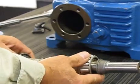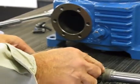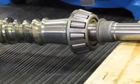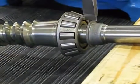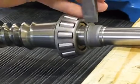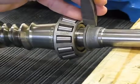Remove the pinion from the gearbox. This is the wear sleeve or wear ring that we have to remove. We support the pinion or worm this way and chisel about three different locations without hitting the pinion.